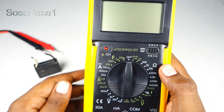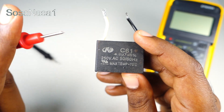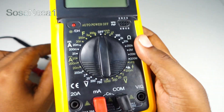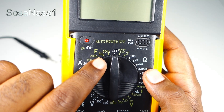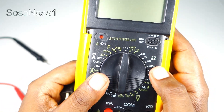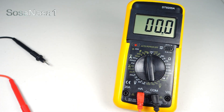Now set up this digital multimeter. If we read on the capacitor here, we read 4 microfarads — this is the capacitor unit, microfarads. We only need to search here on the multimeter for microfarads. Look here the symbol. We have 4 microfarads on the capacitor, which means we need to choose a higher number here — in this case, 200 microfarads. Now our digital multimeter is ready.